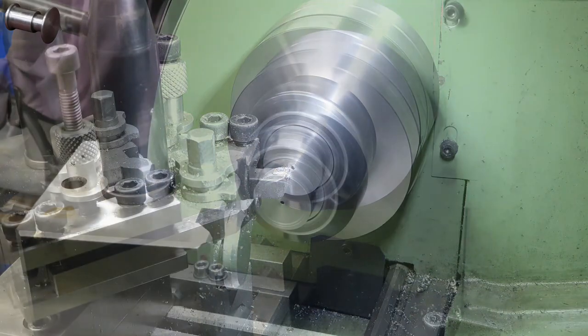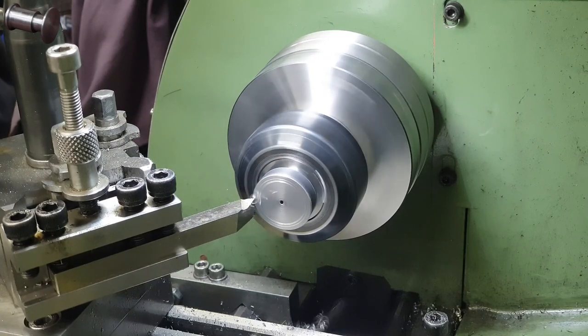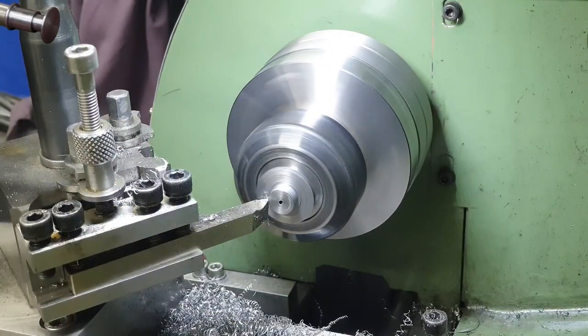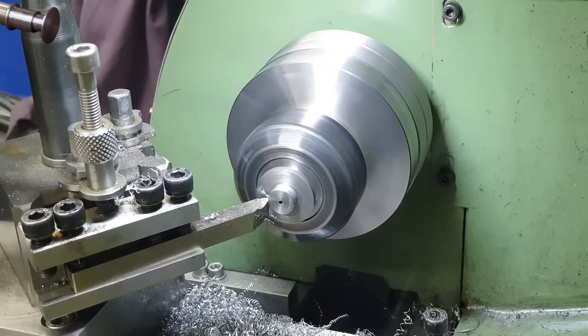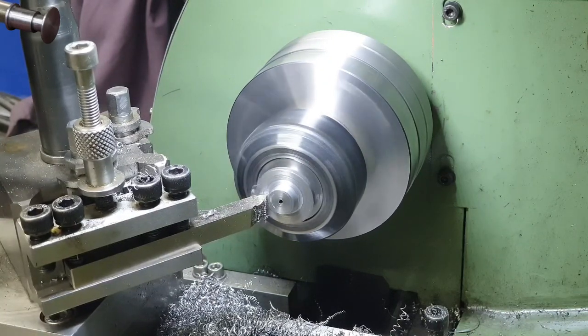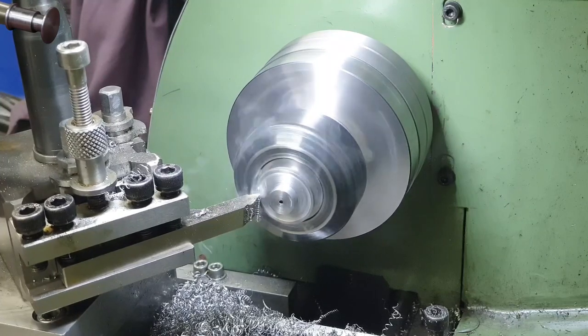At this end it's a simple case of turning a shoulder that will need to be threaded half by 32 TPI, but also to turn the outside diameter and the depth of the flange. Because I wanted to get a really tight corner on this shoulder I used a thread turning tool because it's got a nice point on it. On the final cut I turned it to diameter and also cleaned up the face of the flange.